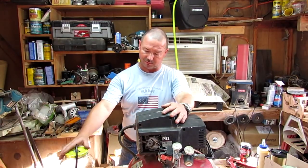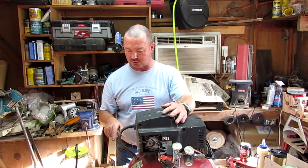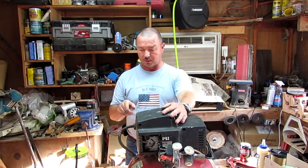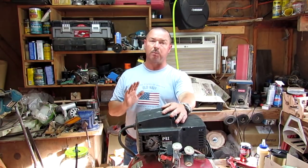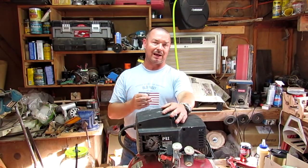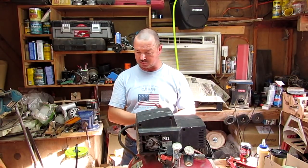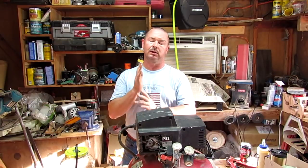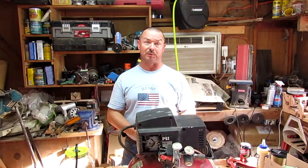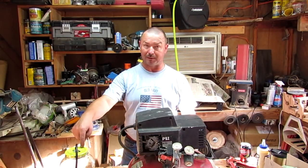I have my experimental vacuum chamber here and it's still at 23 inches of mercury. I'll show you that again later if you'd like to see it. I should have no problem using this to stabilize spalted blanks or dye blanks and things like that. Following the instructions, I think they can't be very big blanks, but that's what I'm doing right now, experimenting. I've got some that are dyed, and they're in here being dyed right now.